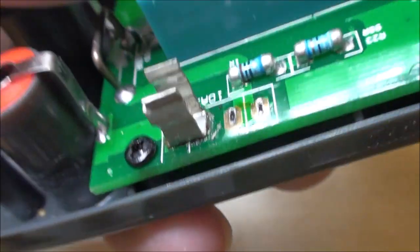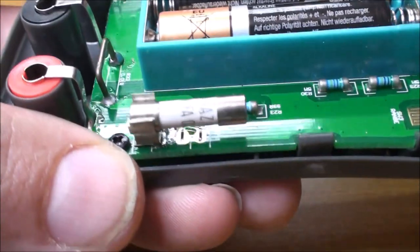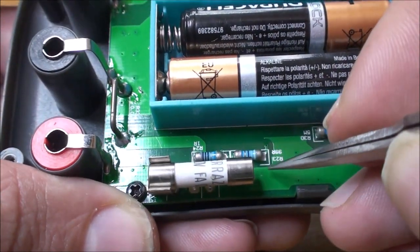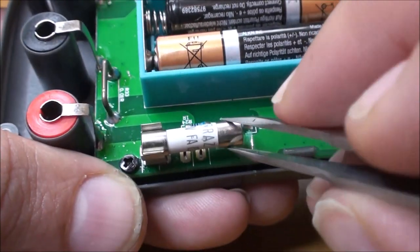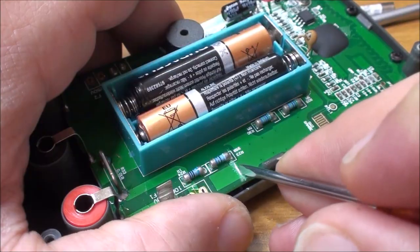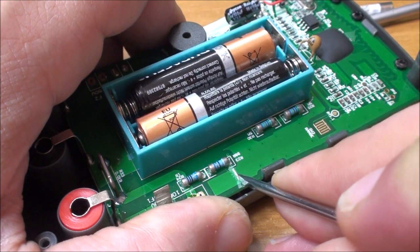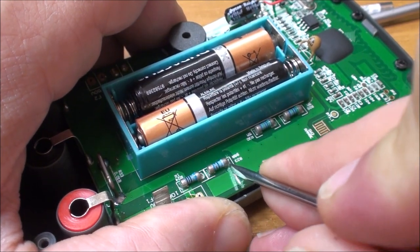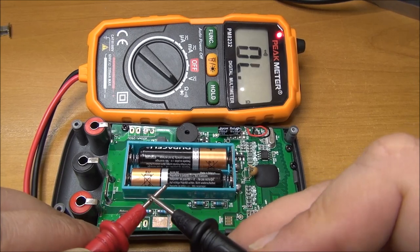Fitting the fuse like I do permits you to trace a limit for a cut in the ground plane. As you see, you need to cut the mass plane like I do to create a support for the fuse holder. This is what I call cheating a little bit. To know where to cut, just put the fuse and cut underneath, or just cut beside the leg of the resistor. And of course, don't forget to ensure the discontinuity of the two parts.